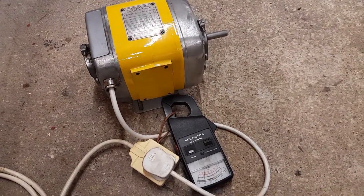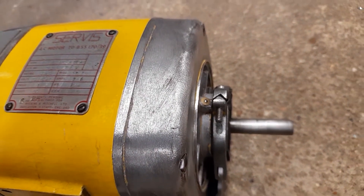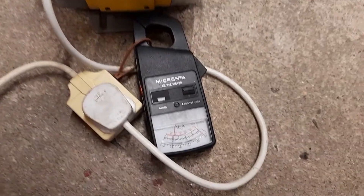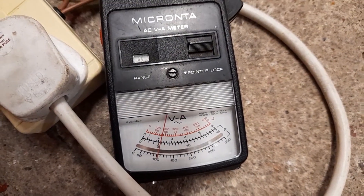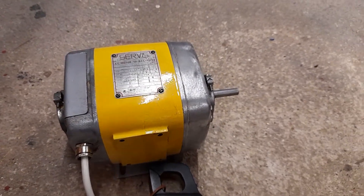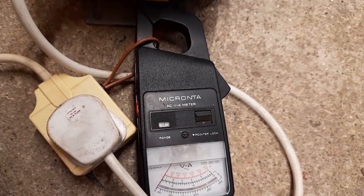Let's run this. Hopefully you saw the needle flick for a moment — it is running. It's sometimes difficult to see in a video because of the frame rate, but that's running fine. You'll notice it's also running fairly quietly — not bad at all. I'm not getting a shock off it either, which confirms the insulation is good. We're pulling just fractionally over two amps, which sounds about right. Let's stop it — and in a moment when it almost comes to a stop you'll hear the centrifugal switch click. Starting one more time — just over two amps.